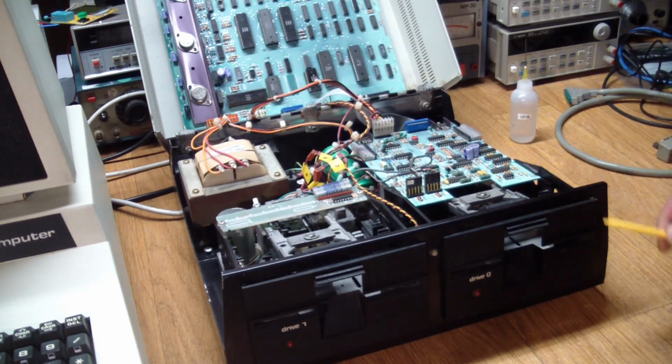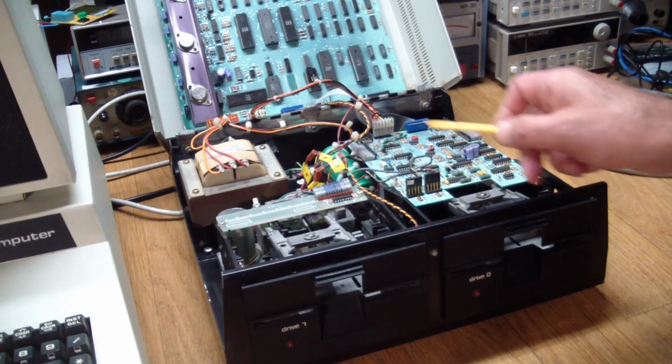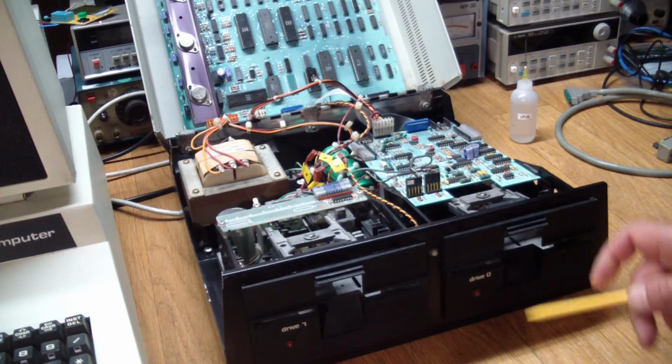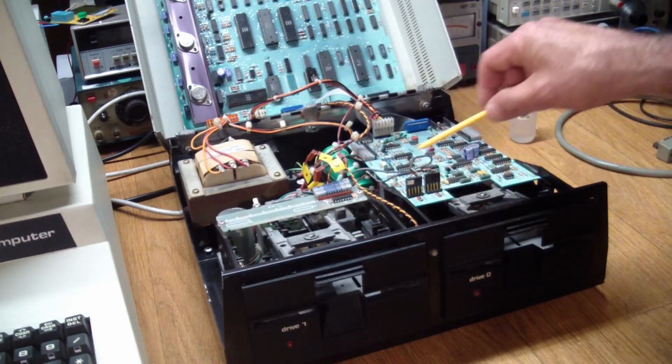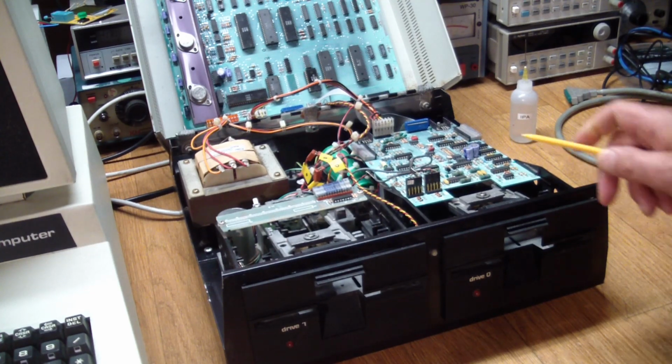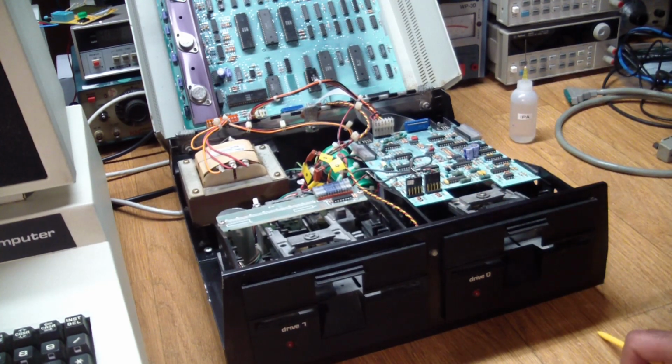spun, but there was a really loud squeaky noise coming from both of them. And as I had suspected before, the spindle bearings in both of them hadn't really gotten cleaned up by all of the lubricant I poured in there. And I think the problem is that those bearings are sealed. So it's kind of like sealed pots. Dirt gets in, but it'll never get out. And it's the same with these. There's probably rust in the bearings inside, and they were just screeching very loudly.